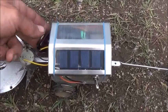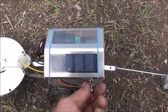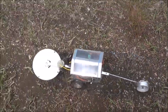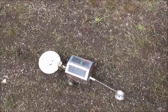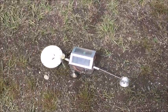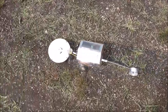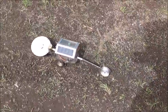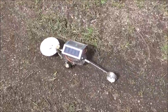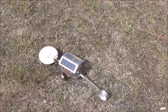All right, let's go ahead and turn everything on. Let's turn on our weed-eater, and let's go ahead and turn on our bot. And there we go. So there's SolarBot off to do its job out in the field. It's going to stay within the valley of each one of the rows, chewing up the weeds, creating its own line. And when it hits the end of the row, the front guidance wheel will turn it and realign it down the next row.